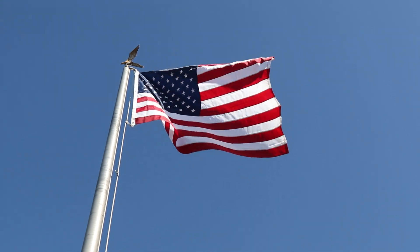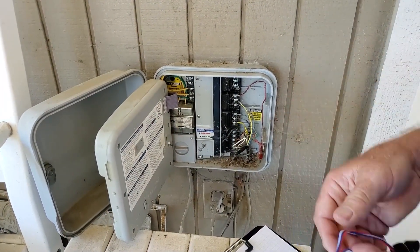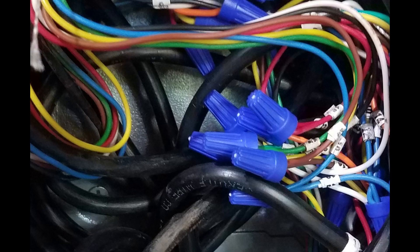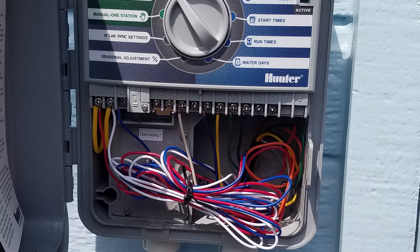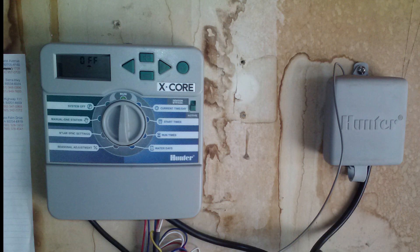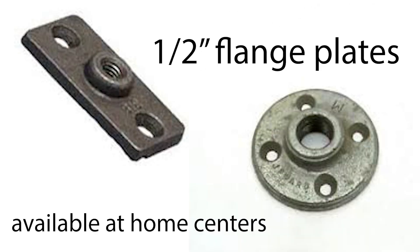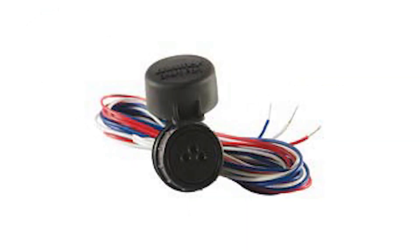We have our wires — nice American red, white, and blue. You can cut this wire to length if you want, but I just don't — it's a preference of mine. The exception is when the timer is stuffed with wires and there just isn't room for all this extra wire. The reason I leave it is because if there's ever a change like the location of the timer, or if somebody wants to use the optional mount to install this into a wall on the outside, then they'll always have the wire they need without having to go out and buy new wire.